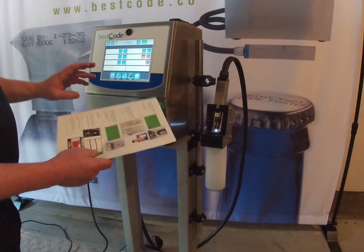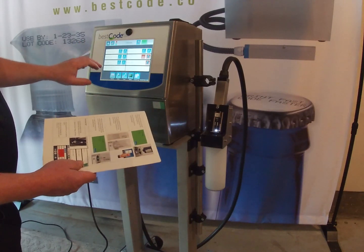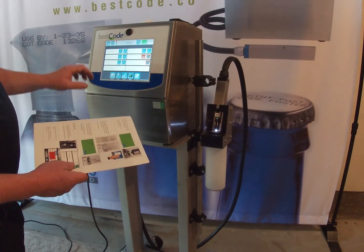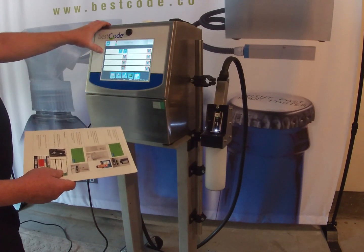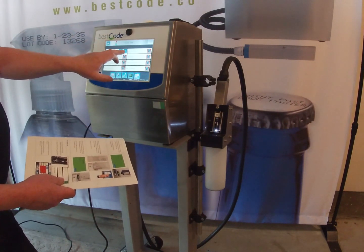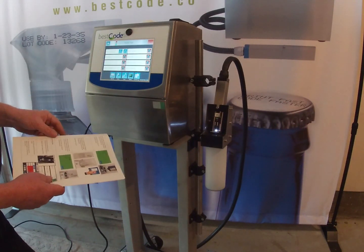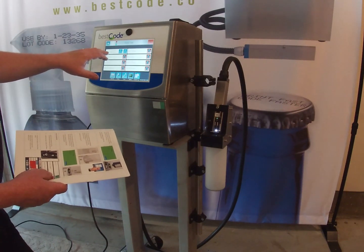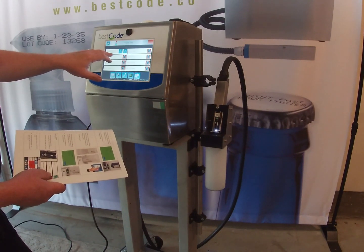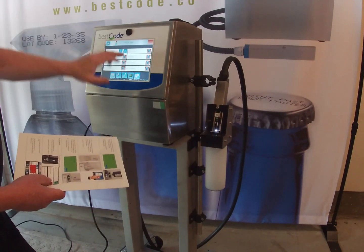So what I do typically, instead of doing this, is go back into the home button, go into service and then fluidic, and at the top here we have a manual pump start. So what I would do is manually start the pump, putting in around 6 RPS, and it takes a while for it to take action, but after a little bit you will see it come up to 6 RPS, and then the PSI would be around 4 or 5 PSI.